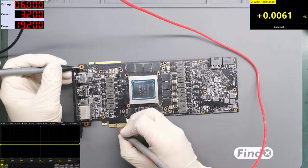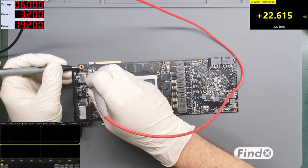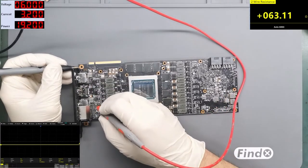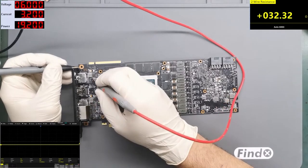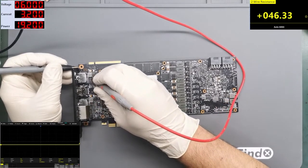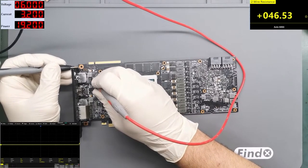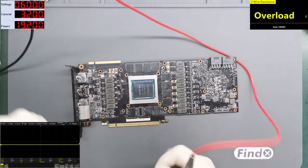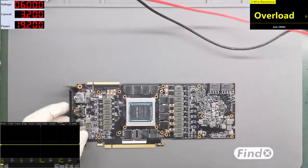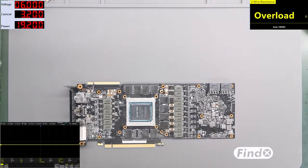The PCI is 12 volts and the 3.3 volts. Also kiloohms. Here the PEX rail and the 1.8 volt is down there. So this actually is the PEX and this should be the 1.8 volt rail. It's kind of low. Alright, so let's continue. I will switch over to the microscope to show you exactly what I have noticed.